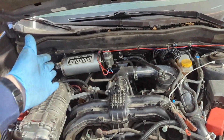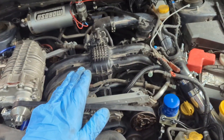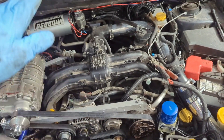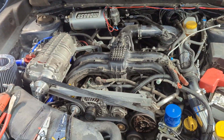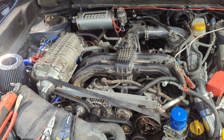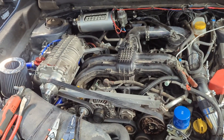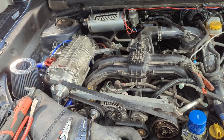I don't think with this one and a half quart system that would be catastrophic, but it will start to overflow the oil sump — your oil pan will get that extra one and a half quarts of oil. Then you might have issues with oil aeration. The crankshaft will start lapping that oil and creating a frothy mixture, which will cause lower oil pressure.